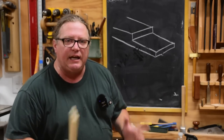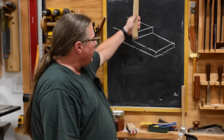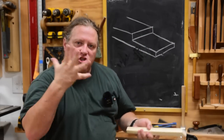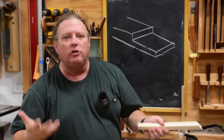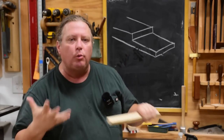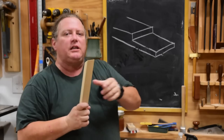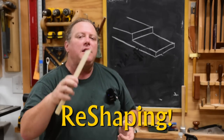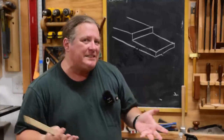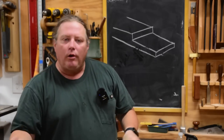So all those basic techniques that we've been doing for your entire woodworking career, you know, chopping straight down, planing all the way across, splitting stuff out. Well, if you step back and think about it, apply the knowledge you want. Apply how maybe you might be able to position your hands to do different things with your chisel. Arcing instead of pushing through. Slicing with the corners instead of using the entire edge. That kind of stuff. You can manipulate the interaction of the wood with your tool. So in effect, those basics are wrong because you now have the knowledge to do it better another way.